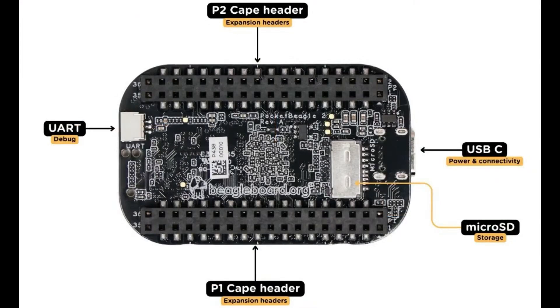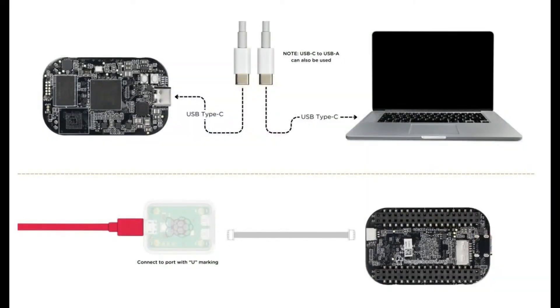On the opposite side, there are the standard CAPE headers — two 2x18 headers, which is actually two 36-pin headers. There's a UART port so you can log in directly without going through USB. There's optional microSD storage. The CAPE headers are kind of what people expect to use because on its own, while the hardware is really good, you'll want to connect external hardware to access the GPIO, connect a TFT screen, buttons, sensors, and so on. There's a USB port on board that connects directly to the chip so you can bootload directly.